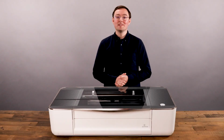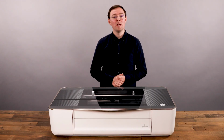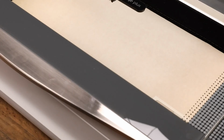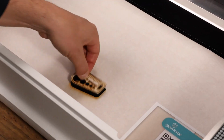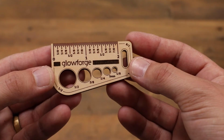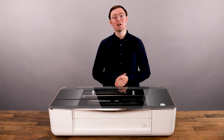Now, once the print's done, the printer head's going to return to the top left corner, and the button on the Glowforge will stay lit while the fans continue to whisk away the last wisps of smoke. When it stops glowing, you can open the Glowforge and pick up your finished print. If you have a Glowforge air filter attached, we recommend leaving it running for 1 minute for each minute that you print. It helps to prolong the life of the cartridge.